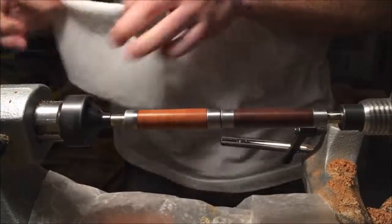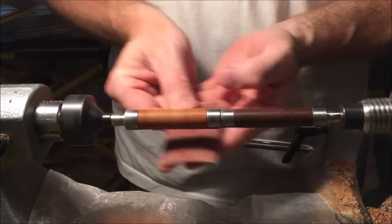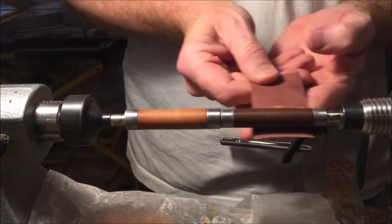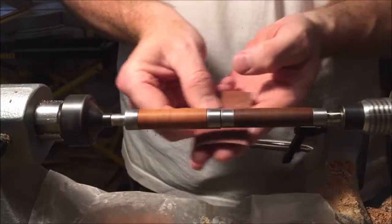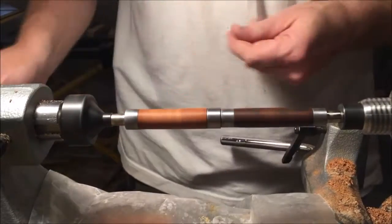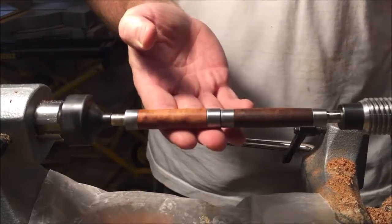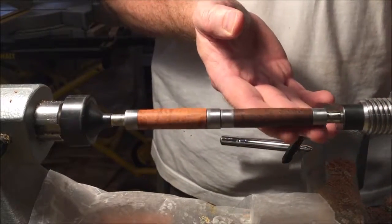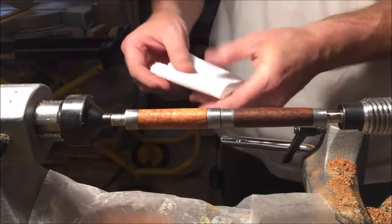Next, take a small piece of 600 grit sandpaper and go across the piece, really just looking for any amount of CA glue that hardened in a lump. Once you finish going across a couple times, you really just use your fingers to feel along to see if there are any ridges that you missed. From here, it's lather, rinse, repeat. Continue this step for as many coats as you wanted on the piece.